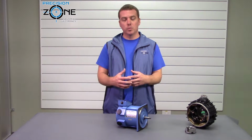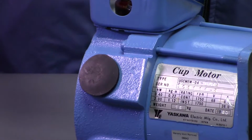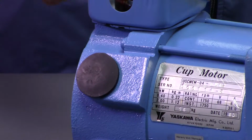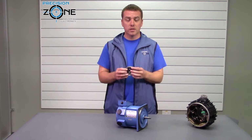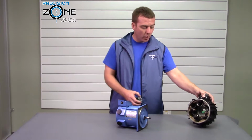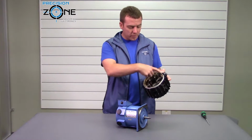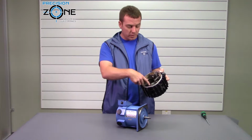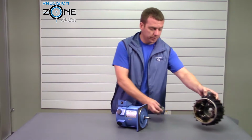As the motor turns, the DC brushes are consumed. The consumption of those brushes leaves behind dust, and the carbon dust that's left behind is an excellent conductor of electricity. Now, you could only have 2 brushes in a simple DC motor, or you can have up to 12 like this big boy here. And if you can imagine all this dust getting filled, this area being filled with all this dust, it's going to arc and ground out the motor.